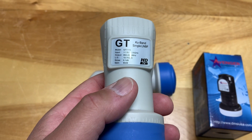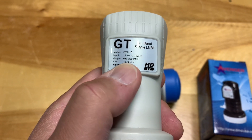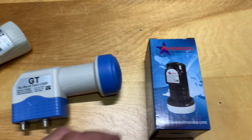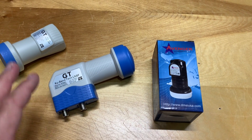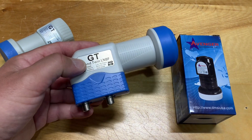Here are a few examples of Ku-band LNBs. This one is known as a standard Ku-band LNB, and that has everything to do with the frequency that the LNB operates at. I have a video that explains all this in much more detail. This is as simple as it gets as far as LNBs go — this one is a single output, so it allows you to connect to one satellite receiver. They also make universal type LNBs, which basically do the same thing with a little difference in receiver setup, but they'll get you the same channels on Ku-band satellite.